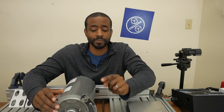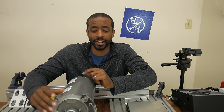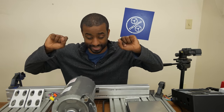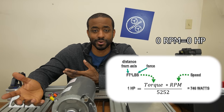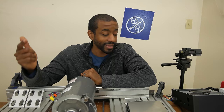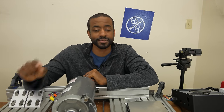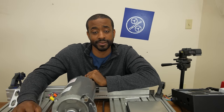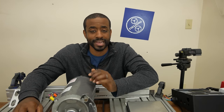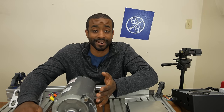That also excludes locked rotor torque as a variable — that's the maximum torque the motor can put out when the shaft can no longer rotate. The RPM is zero, so if you put that into the formula you get zero horsepower. So that doesn't make sense as a measure of peak horsepower either. Here's what I've decided to do: I'm going to load this motor as much as possible and keep cranking up the load until both the RPM and the torque start to come down. Then I'll know I've passed its maximum output — or the motor will flame up and explode. That's entirely possible with this kind of motor.